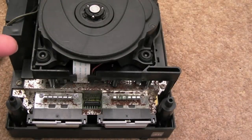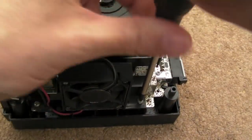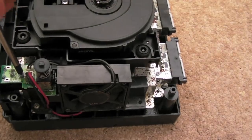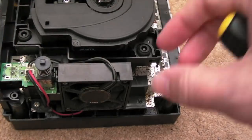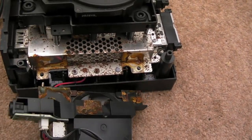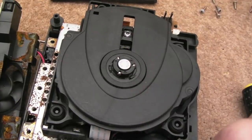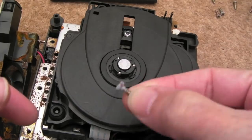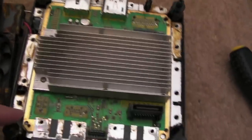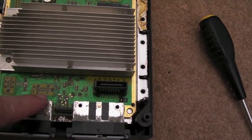The main thing is this one's booting, so it's got a good chance of being repairable. If anything, we're going to have a problem with the drive, maybe a problem with the power supply. That LED not being lit is worrying me a little bit. Look at that screw — it's mega corroded. It's a miracle this thing's even booting, to be honest. The design is actually quite good here — the ground that goes around the edge is fairly tight, which has meant the corrosion stayed off the main PCB, although we might have a little bit down in this area.